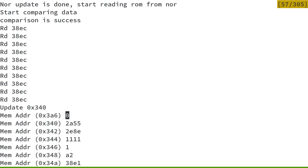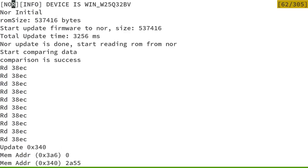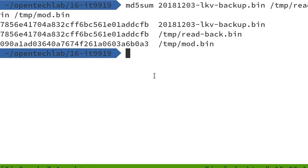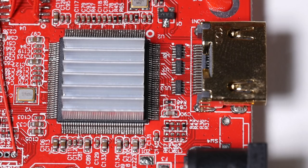Looking back at the captured serial output, it turns out that the 'update' text has not been replaced by X's — it's been reset back to how it should be. It looks as if the device noticed that I modified the contents of the flash chip and decided to reload it. This particular controller appears to have some kind of checksumming feature and is working with the other microcontroller on the board to reload the flash data. Reading back the contents of the flash chip and comparing checksums confirms that the flash now contains byte-for-byte exactly the image we started with — not the modified image I tried to load. So at this point I haven't discovered anything particularly amazing or new beyond what was already discovered by various people, but I'm certainly really intrigued by this device.